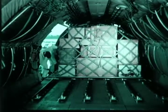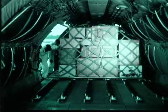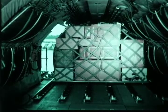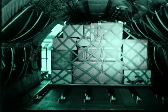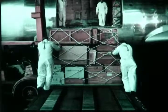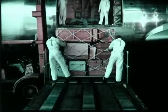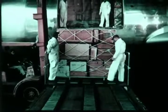Pallet loads are shaped to conform to the aircraft's fuselage. Light disposable or knockdown containers conforming to the fuselage may also be used. Loading and unloading need not be done on a level surface. This system operates equally well on the standard cargo loading ramp gradient. Now that this system of cargo handling has proved to be adequate in test situations, further improvement will come from refinements of design.